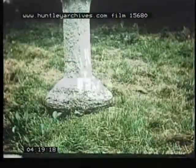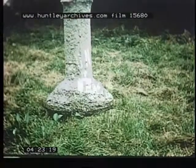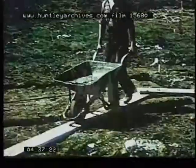Here is a typical under ream pile which has been removed from the ground. Note the clean and accurate cut made by the under reaming blades. The casting of the ground beam over the heads of the piles is then dealt with in the same way as for the straight bored pile foundation, with ashes in the bottom of the trench, building paper and reinforcement.